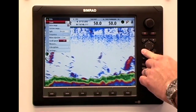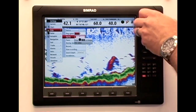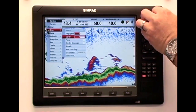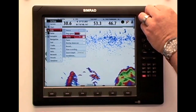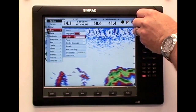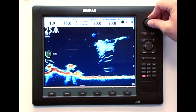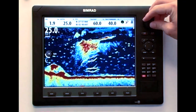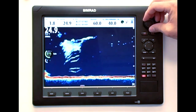The first feature to adjust is clarity, so you can minimize the amount of clutter on your display without losing key targets. The zero setting allows for the maximum amount of clutter on the display, while the 20 clears the screen completely of clutter, showing only the largest suspended targets. A good starting point for clarity is 2, then gradually increase the setting to suit your viewing preference. The adjustable gain can be used to increase or decrease the amount of information seen across all depth ranges. To get the most out of your signal processing power, use the auto gain setting, then you can adjust or bias the gain up or down to suit your needs.